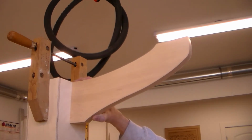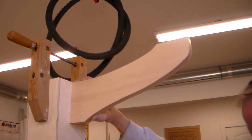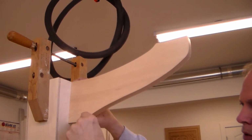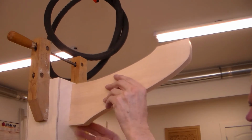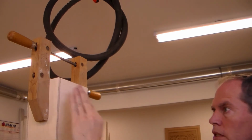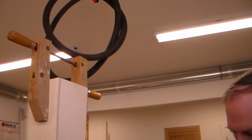I believe I'll dowel these in, stitch them into each panel, and then see how things look. Before I get carried away, this edge is gonna get rounded over right to there. This inside edge here will just get sanded over, but this edge will get rounded over, and this is going to get glued together and rounded, this corner I mean. So it is a nice piece of work. I like it.